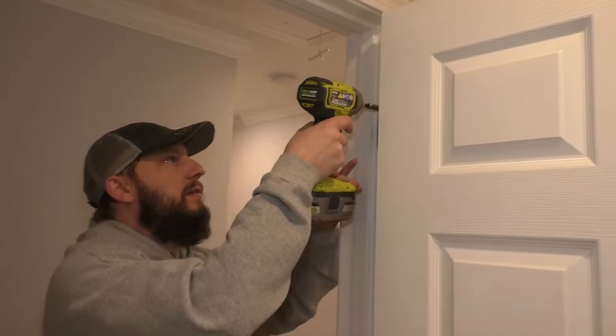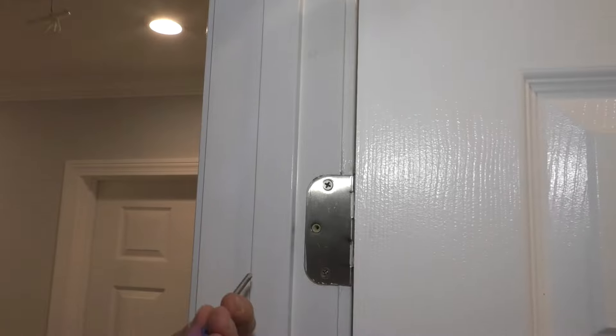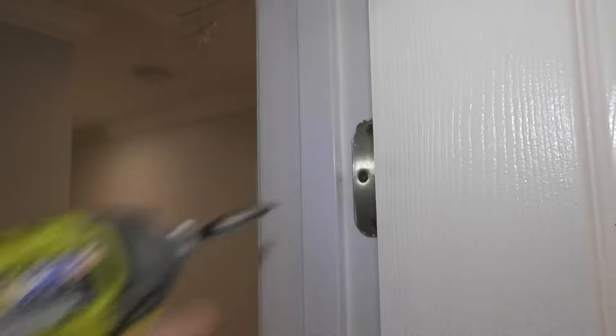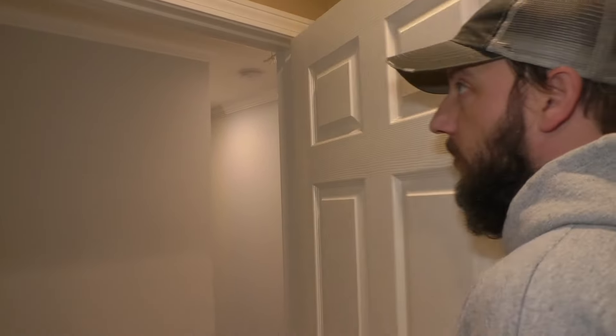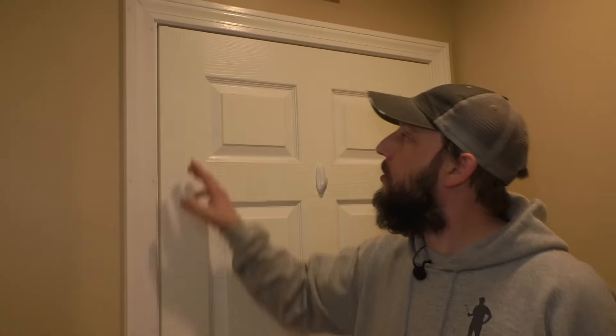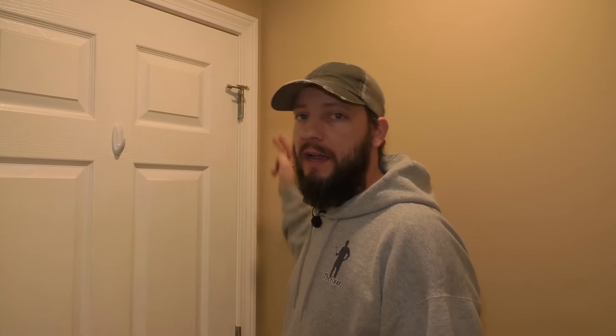In real time, check it out — this is the easy fix: tighten up these screws and then put your long screw back in, and your door should close perfectly. That's also where you can adjust your reveal to make it even and make it look nice. I put a long screw in each hinge so that there's no movement, and when I install the door I put shims behind each hinge before I put those screws in — that way the door isn't going to move. Hopefully this video helps out. Thanks for watching.